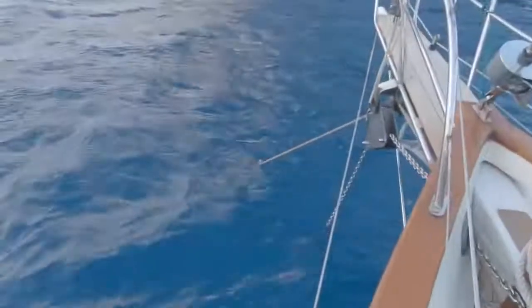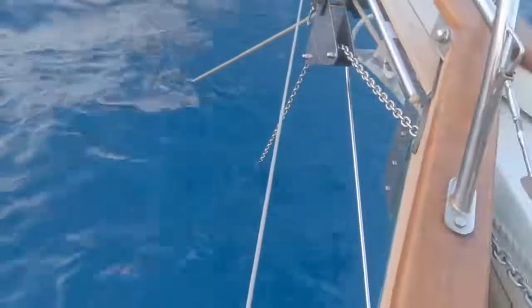We've had the Delta on board for four years, used it all the way from Holland through the UK, the Channel Islands, Scilly Isles, down through France, Portugal, into the Med. So we've got a good idea of its strengths and weaknesses. It's an anchor that does have a tendency not to set first time, and it does heap rather than dive down, which gives it more of an aptitude to drag. We've had three occasions when the anchor dragged after being properly set — one was in soft mud, and the other two were after a wind shift where it failed to reset.